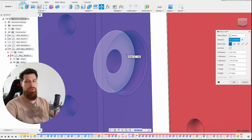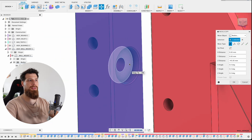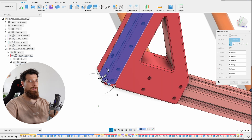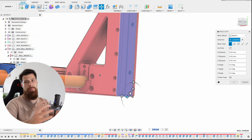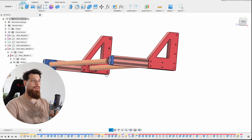Here you can see some cutouts for the wall screws. These are hex screws which go into the wall with a special cutout so they will not interfere with the bracket. They are 6 millimeters in diameter and should be plenty strong for this application. By going to the top view you can see how this goes into place - you just slide it in and then go with screws from the outside to the inside where the brass heated insert would be, clamping everything together and keeping your filament safely secured. Quite simple but effective.